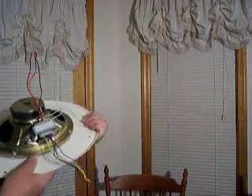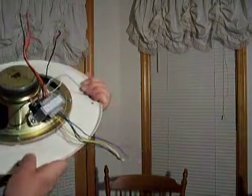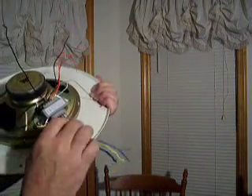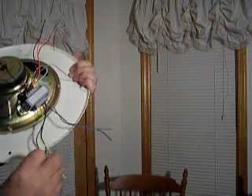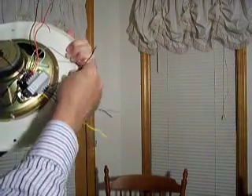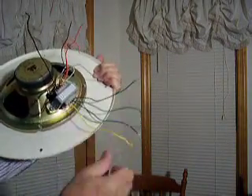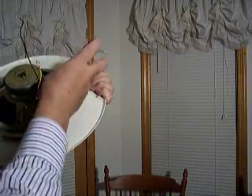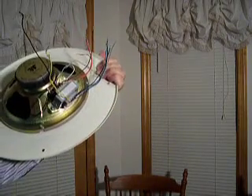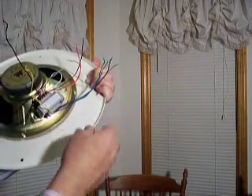Let me show you again on the speaker. You've got to watch carefully because purple and black are pretty hard to distinguish on this transformer. This down here is purple, so don't hook to the purple — push it off to the side. This is the black one. You would hook to black and you would hook to yellow, and just take the rest and simply ignore them. It's that simple. You could cut them off and put some black tape on them.